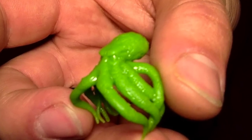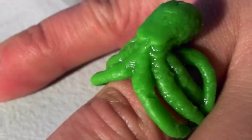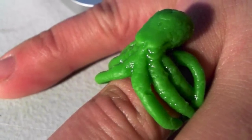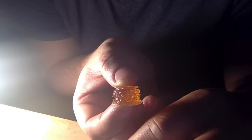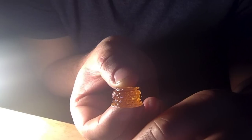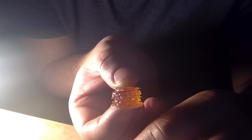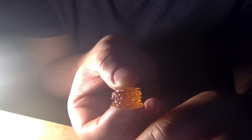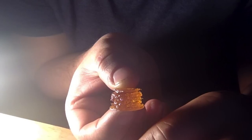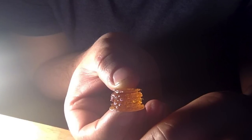These are some of the prints that came off of the printer — the pictures really don't do it justice. And this right here is what happens when the printer wasn't quite focused. Don't worry — all it is is that the printer isn't quite focused. Move where your projector is mounted, see if maybe that's the issue, check if your focal length isn't proper. Adjust and tweak with it, and your prints will come out fantastic.